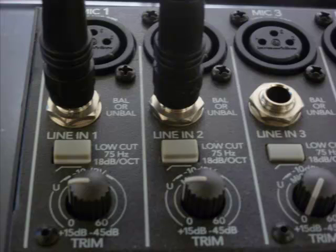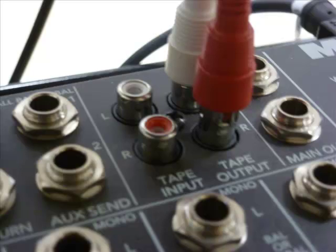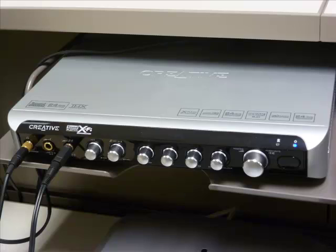If you later find that you are not getting a strong signal, a preamp can be added to the chain to amplify the signal, but you always want to use the cleanest path possible during digitization. Only put in as many steps into the chain as necessary. The tape output cords will be plugged into the left and right channels and lead to the digital converter. Here they will plug into the line-in hole on the analog to digital converter. From there, you should be able to put on the headphones that are plugged into the digital converter and hear what is on the tape if you press play.